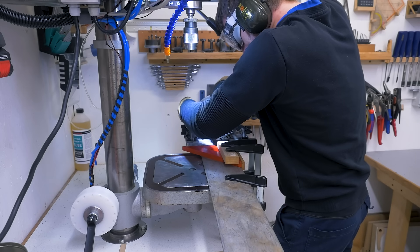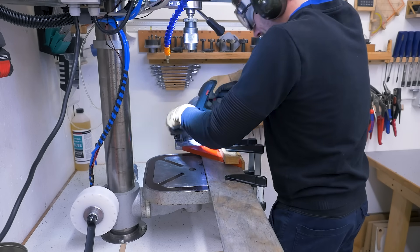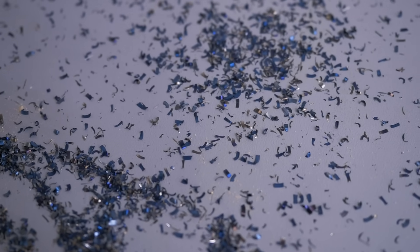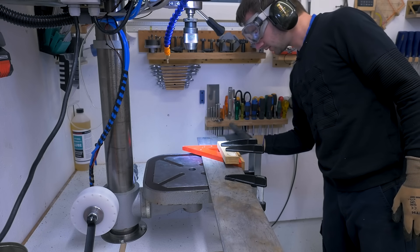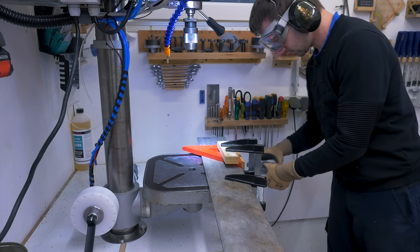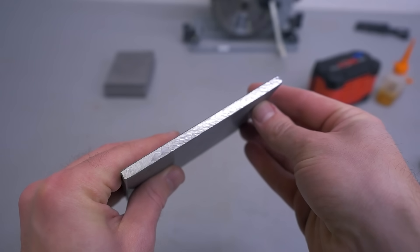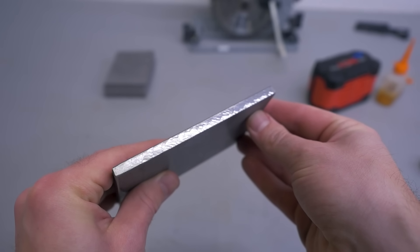You can't really see anything now, but it's not all that interesting. A good sign though is all the chips are bluish, which means the heat from cutting goes into them and not the part or the blade. I can touch it almost instantly after cutting. And this is the best cut surface I got — not spectacular, but fast.